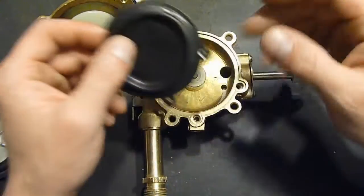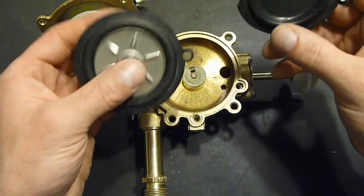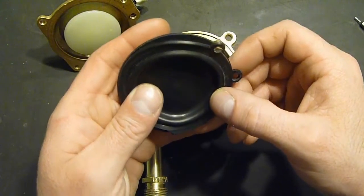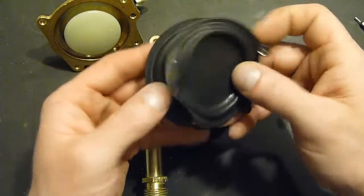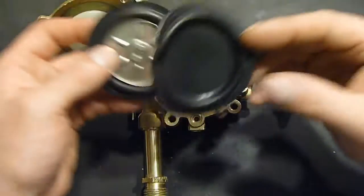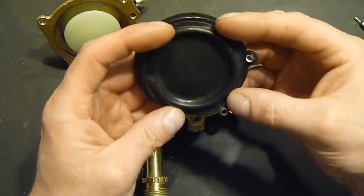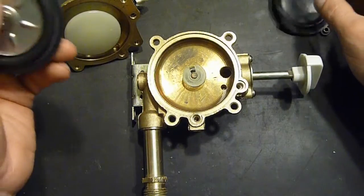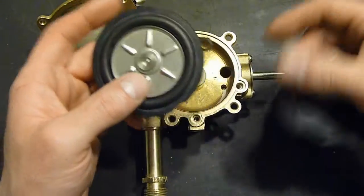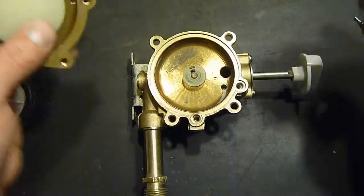So anyway, I ordered the Paloma part because it was 25 bucks and it was approximately the same outside diameter. The diameter that was listed in the auction was in inches, and obviously this one would have been in millimeters, but disregarding that, I used a caliper and figured out, okay, well, it's very close. So the thing is, obviously the Paloma is built a little bit better. Its little flow tube here is larger and presumably has the drain and the pressure relief on this side, which would have just made sense.